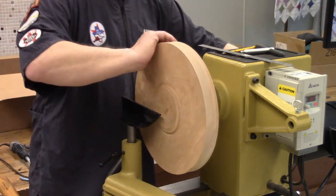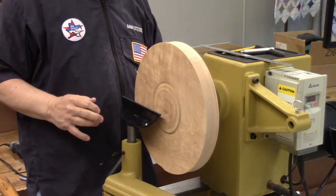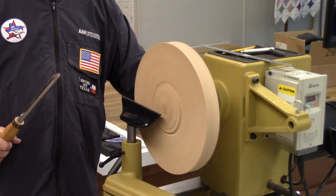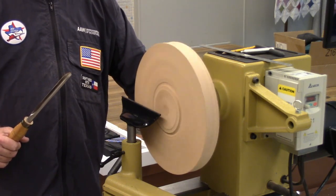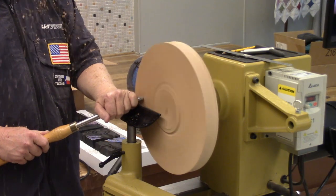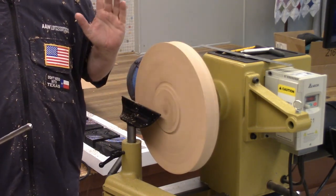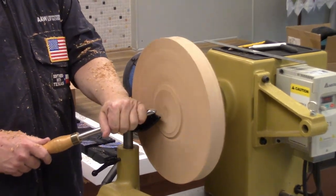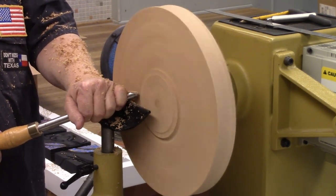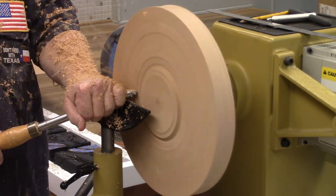Okay. Make one more check. It's on square. It comes on. My goodness, it's moved since I did this 2 days ago. It's about 1,100 RPMs. I'm going to do this up. Jim Bob, I'll put the shield on if you want, but this is pretty stable. Okay. I'm bringing the tip right at center line and facing everything off. I'm going to plunge in here. That's about all the foot I'm going to need.